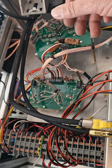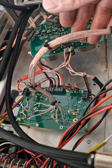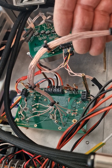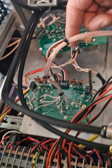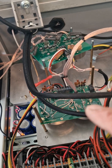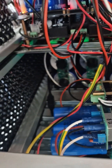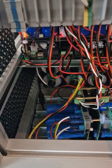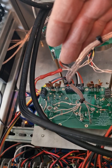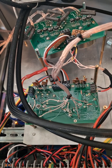I strongly recommend that once you try an active stage it's worth all the effort of the power supplies. I ran this for a very long time on Ian's LiFePO4 battery — 2× 4.5V rails — and it works very well off the LiFePO4. But after 67 hours, one of the negative voltages dropped off a bit — maybe the battery is getting old — so it wasn't man enough to run all 12 JFETs.